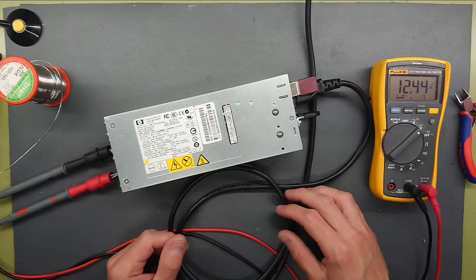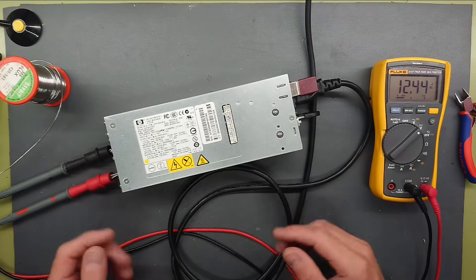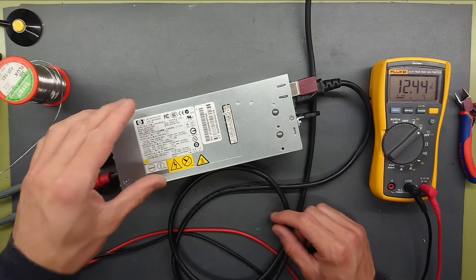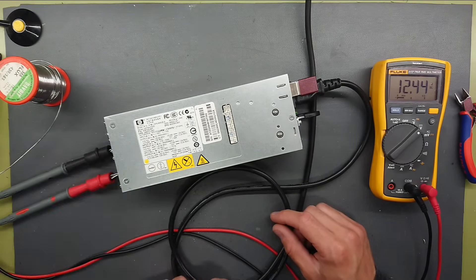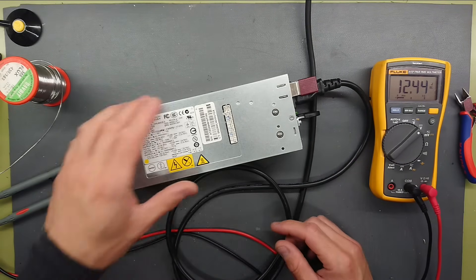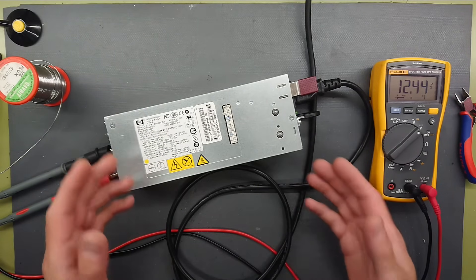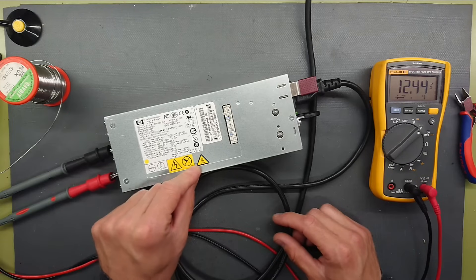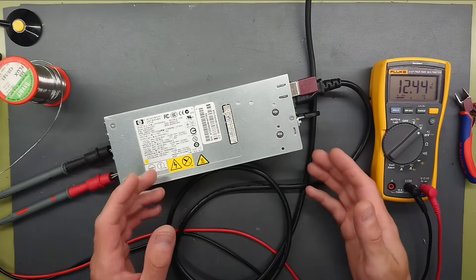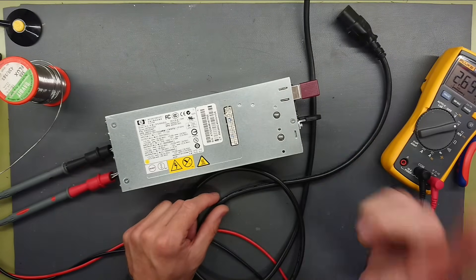From reports from others who have hacked this PSU into running, the fan noise will not get much worse unless you push it for 10 to 15 minutes at full load. I hope you enjoyed the video. I hope you will forever keep any server power supply you come across, because these are very cheap — if not free — powerhouses that you can reuse for so many projects. You can parallel almost as many as you want, and you can put up to three in series for up to 36 volt DC. Until next time, see ya!